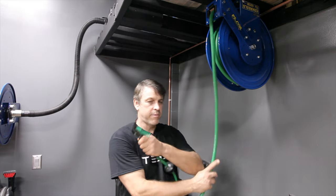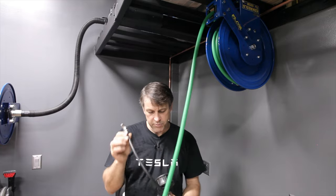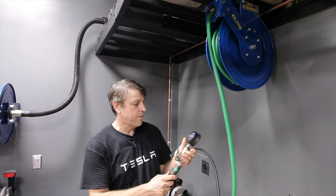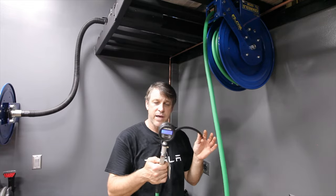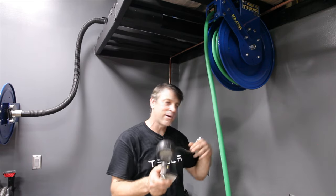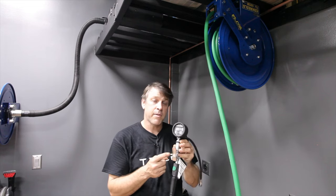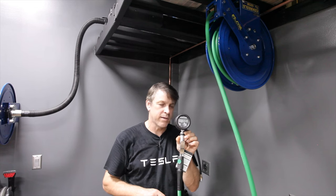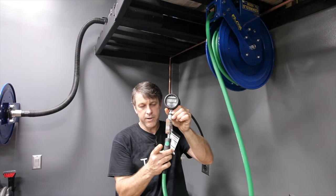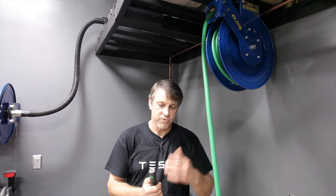Let's try something different. With the Prevost safety disconnect, you press the button and it's not going to come off no matter what — then you release the button and it comes right off. I wanted to share the Steelman air filler tool — this thing is just amazing. When we pump up our dirt bike tires, we're looking at super low PSI: 3 to 5 pounds on the outer tube, up to 100 PSI on the inner tube. This thing does perfect measurements all the way down to almost nothing and all the way above 100 PSI. Super flexible hose, very easy to press on — this is the best air fill valve I've ever seen, the kind you'd see in a tire shop or commercial situation. Press the button, nothing comes off; release the button, tool comes right off. At first I thought it was kind of hokey, but it really does work nice — you don't have to worry about dropping your expensive tools.